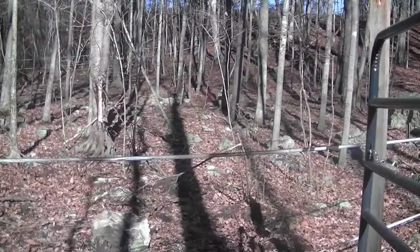When you are measuring, it's hard, because if I grab a piece here, it comes just like that in a square, and you just peel the back off of it, and it's sticky. But so you're going to do your line and your writing and your first cut on the back. A thing a lot of people make a mistake on when they're doing their floor. So you want to make sure to pay attention to your pattern and pay attention to which side you're measuring from when you flip it over.